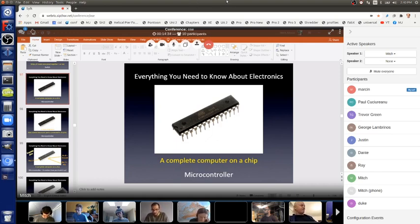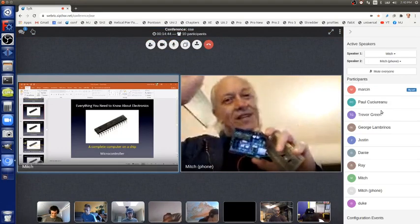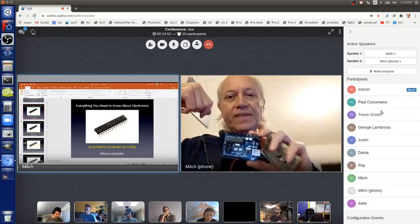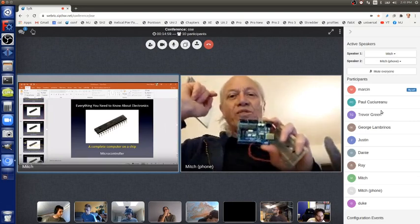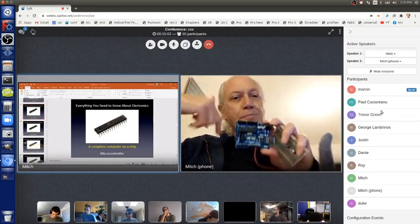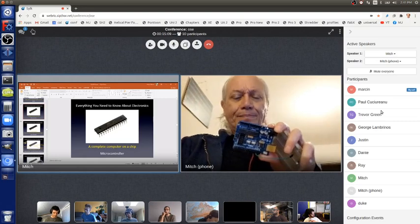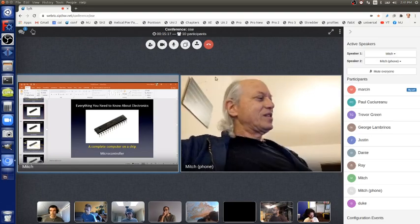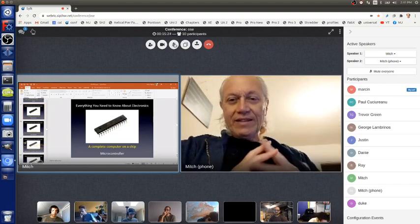So if you program the Arduino board with the Arduino software, and it's the LED blinking program, or the TV on program, or whatever, it stays there for guaranteed up to 15 years. And if you don't use it for 10 years and you plug it in again, that program will still be there, and you turn it on and it runs. If you reprogram it, that program's gone forever, but the new program's there for up to 15 years. And you can reprogram the Arduino program memory up to 10,000 times, which is a lot. The RAM you can reprogram bazillions of times. You don't have to worry about that.